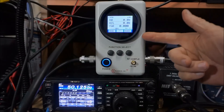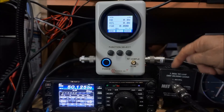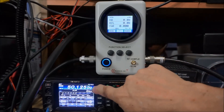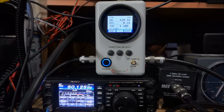I've hooked up the meter using two half-wave cables, one going to the dummy load — an MFJ unit for HF and UHF. The Yaesu is at 50.125 MHz, running digital normal and C4FM. Reaching up and hitting the manual switch to turn it on, you see about 100 watts on the radio — the FT-991 — and we see 110.1 on the model 44D.